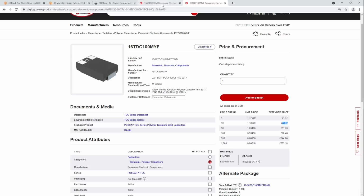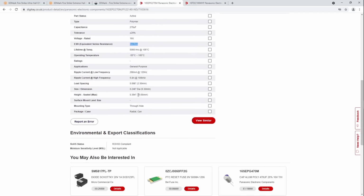The problem, so you might be wondering, why are you even considering the tantalums? Well, these are 6.3 millimeters in diameter. Going back to the whole "my I2C header fits under the stock backplate" thing, these very much don't. By my measurements there's like 4.3 millimeters of clearance under the backplate. So I can't have 6.3 millimeter caps. They're 2 millimeters too big.